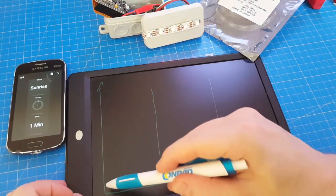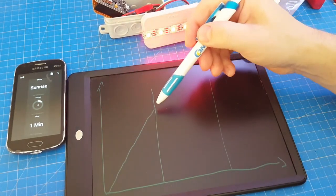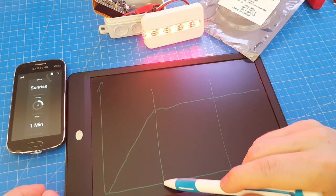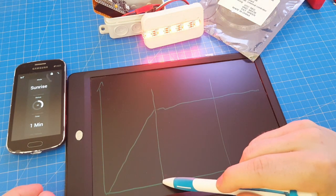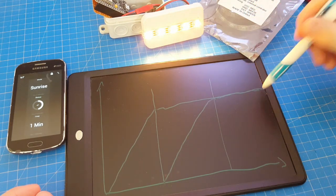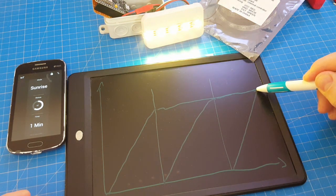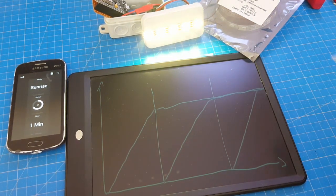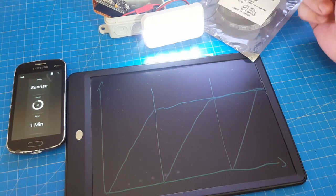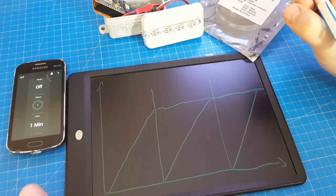In the first third, I raise the value of the red color until it reaches its maximum at the end of the first third, and there it stays to the end of the one minute. When the second third begins, I raise the blue color to its maximum, and there it stays. Same with the last part — I raise the value of the green color. All colors are at maximum and the LED will be white. And when the timer is over, it will reset and everything is off again.